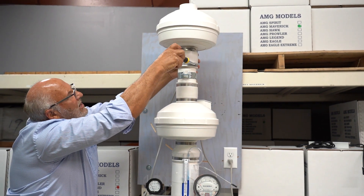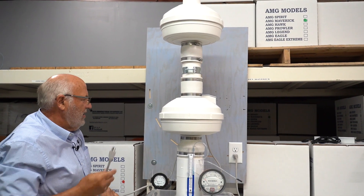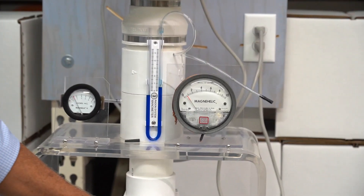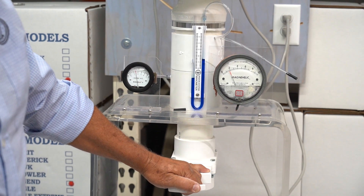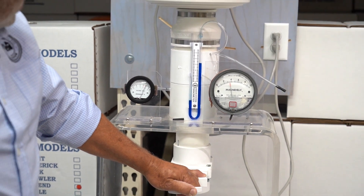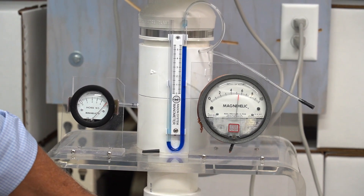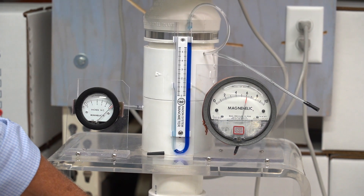So this is kind of cool, in my opinion, what it does. The hard evidence of what it's going to do to double stack — we have the valve open now, so you've got plenty of volume going up, and now we're going to duplicate poor substrate and go up the line. Our in-house manometer that we produce is one of the highest reading manometers you can buy, but it's not capable of more than six inches. So here we are at five and a half, and I can push that up to six inches. The problem is these two fans are capable of a lot more than that.